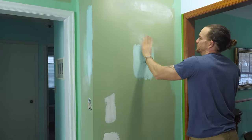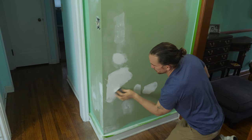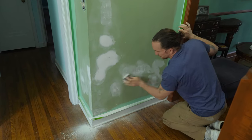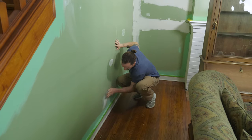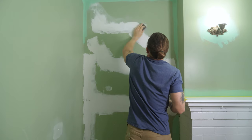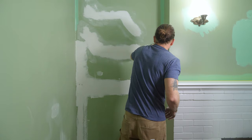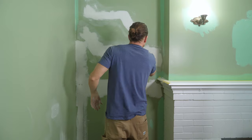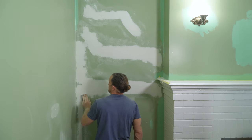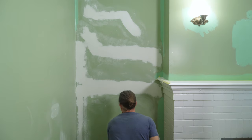When sanding your patches, blend the outside edges — go around the perimeter and make sure to blend all the outside edges. The middle of your drywall patch really only needs a light sand if you skimmed it nice and smooth. Don't over-sand the middle — that's when you create a problem. If you taped and over-sand the middle you'll see little bumps where the tape comes through in your finish. Also, if you're doing a lot of sanding, wear a mask. And vacuum and wipe up all the sanding dust before you start rolling.